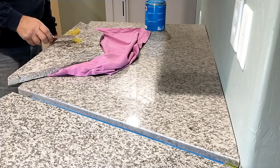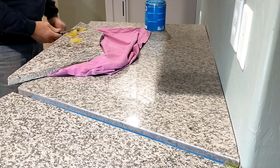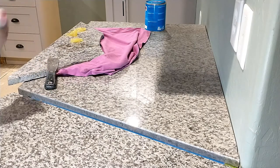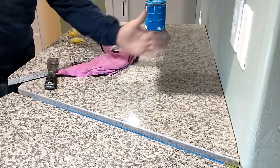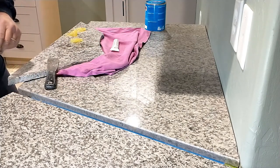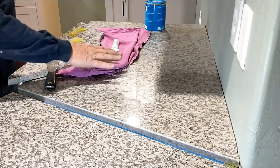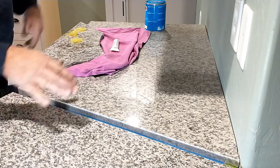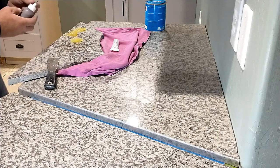The black is the least I need volume-wise — a little bit goes a long ways. I just want some black dots. I'm going to mix the color first, and then after the color is set, add the hardener. Before I slip this piece into place, I'm going to glue it down with some silicone to the deck. Underneath there's a plywood deck under this piece of granite. This piece has already been glued and is in place — you just have the one to slide in. I've done that all the way through on all my seams.